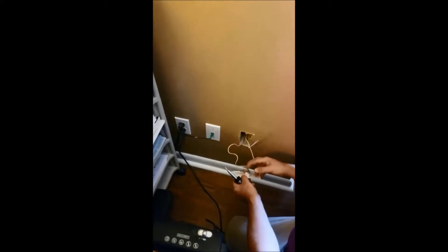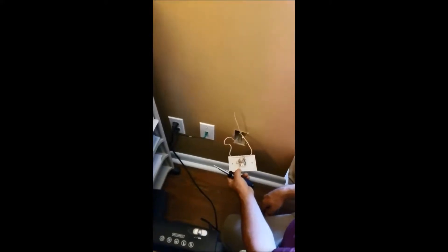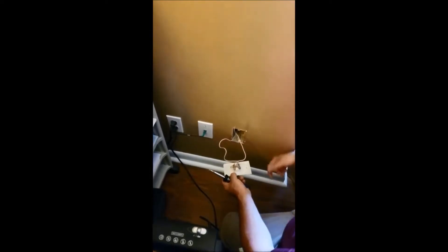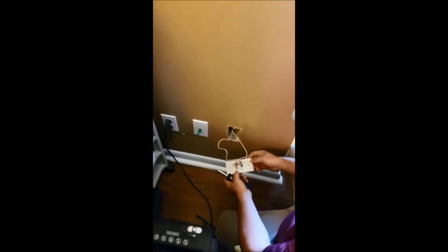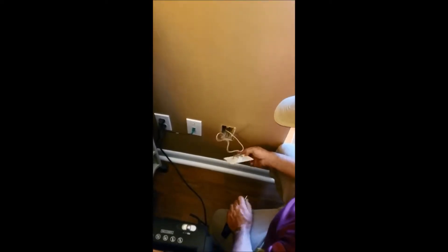The customer does not want it active. Any time we can take something out of the loop that may be causing a problem, we do. We found several corroded wires here from the age of the phone lines — this is about the time frame most phone lines start causing problems. So we're going to bypass as many of those as we possibly can.